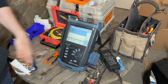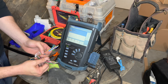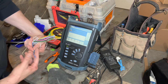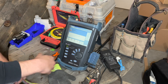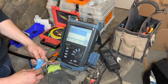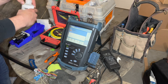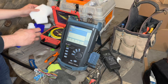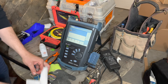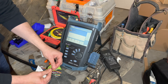There you go, you got your cable exposed. As you can see, you got 12 tubes on the outside, 12 on the inside — 288 fibers total. It's a gel-filled cable. What we're gonna do is take one of our tubes, use the ring cutter, do a couple inches, pop her open. It's got some gel on it so give it a quick cleaning with a little alcohol. You should use D-gel, but for this quick test we're good to go.